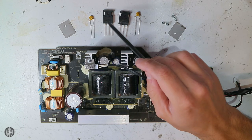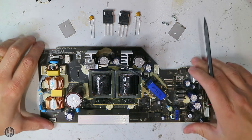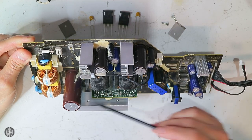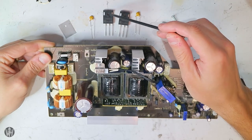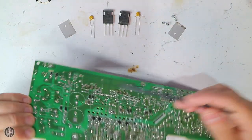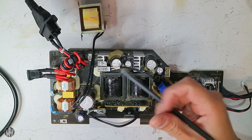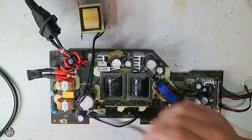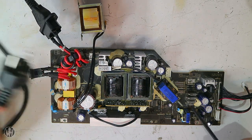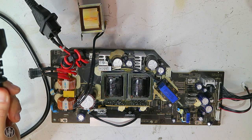Here is the replacement for the damaged MOSFET and the two capacitors. Let's put them in. It's important to first mechanically fix the MOSFET to the heat sink, because the hole of the MOSFET needs to be aligned with the hole in the heat sink. After that, we solder them to the board. I'm ready to check again — the MOSFETs are soldered in and the capacitors also. For safety reasons, I will plug only the AC cable into my isolation transformer from a safe distance in case it's damaged again.